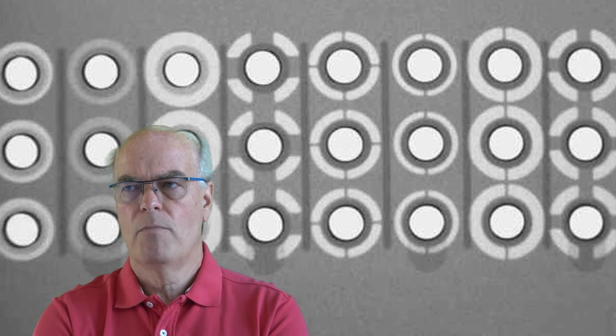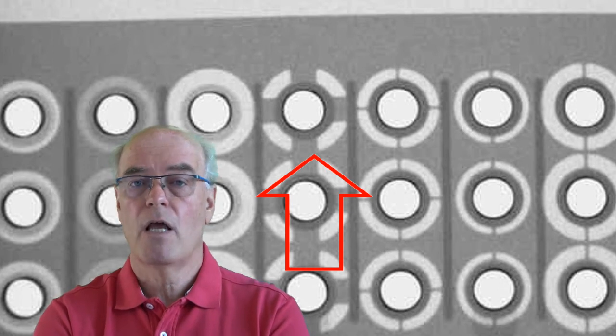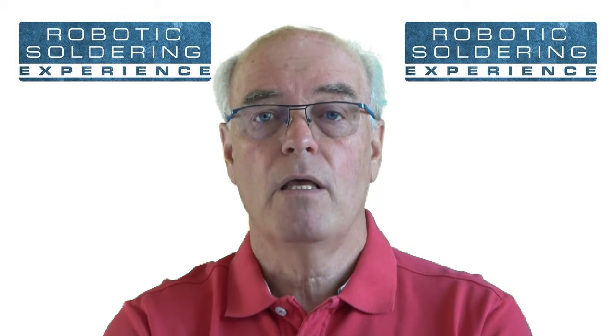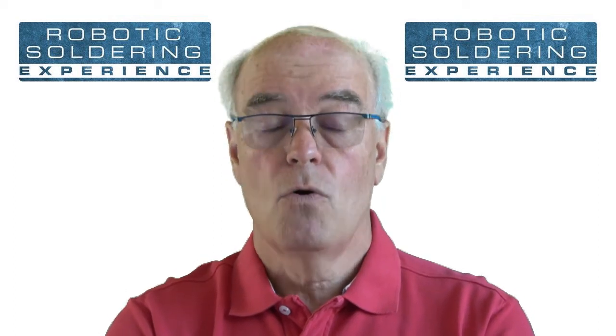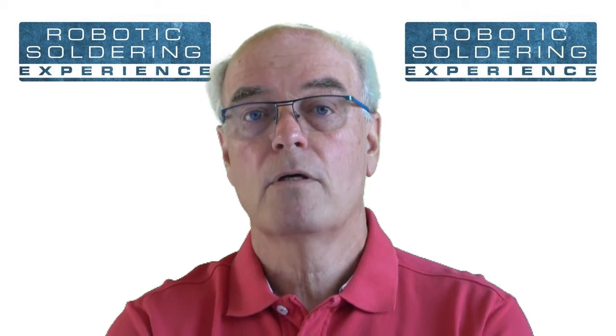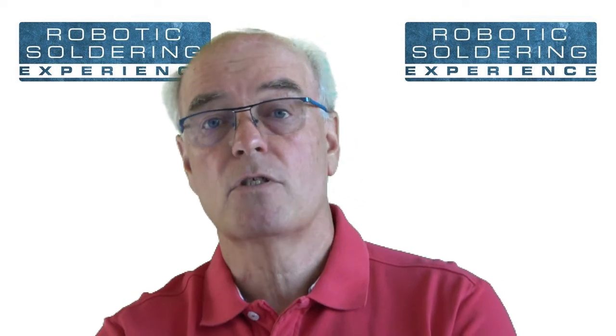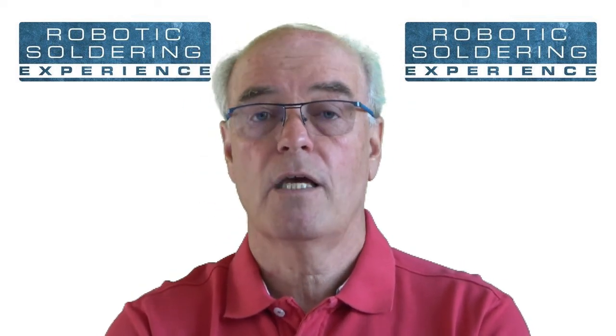So let's say an example is we have one or two joints which have a high thermal demand, but everything else will solder fine. Well, one of the things we can do quite simply is go solder a number of terminations on the connector and then stop, jump over those two terminations that might be difficult to solder and continue with the rest of the connector.